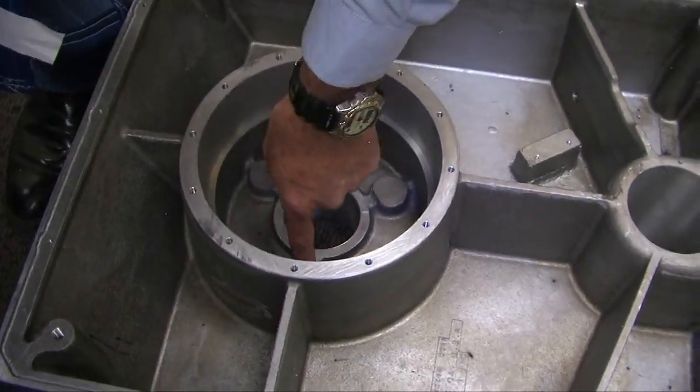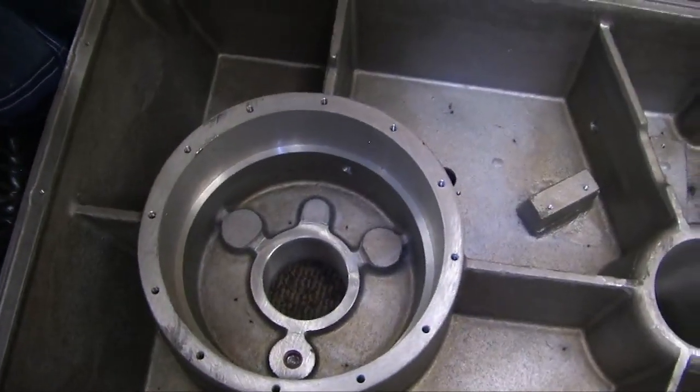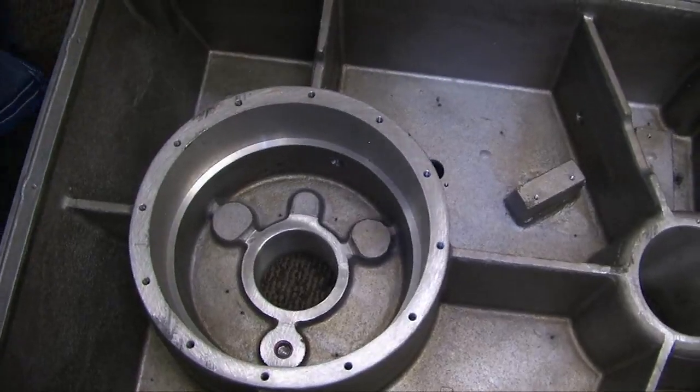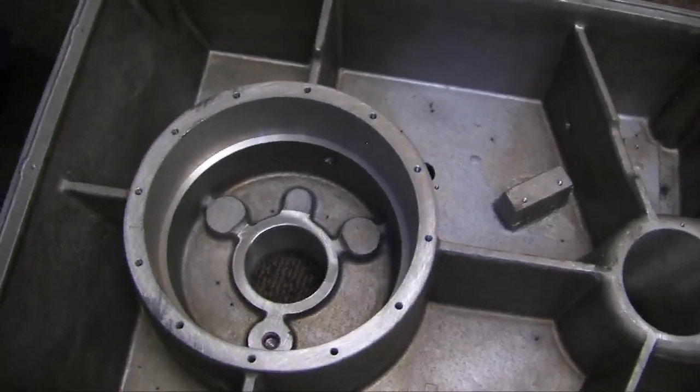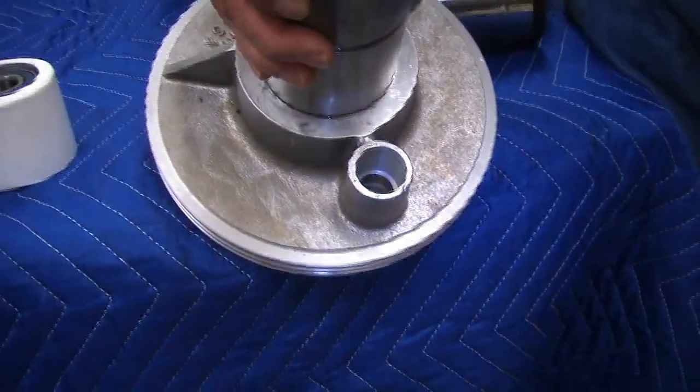In this spot right here, that's a helicoil in there. You're missing a little post that we have in there that guides the platen in an up direction. And I'll tell you right now, it's right here, and there's a Delrin bushing in here that's for wear and tear. It kind of guides it up and down in a straight position.